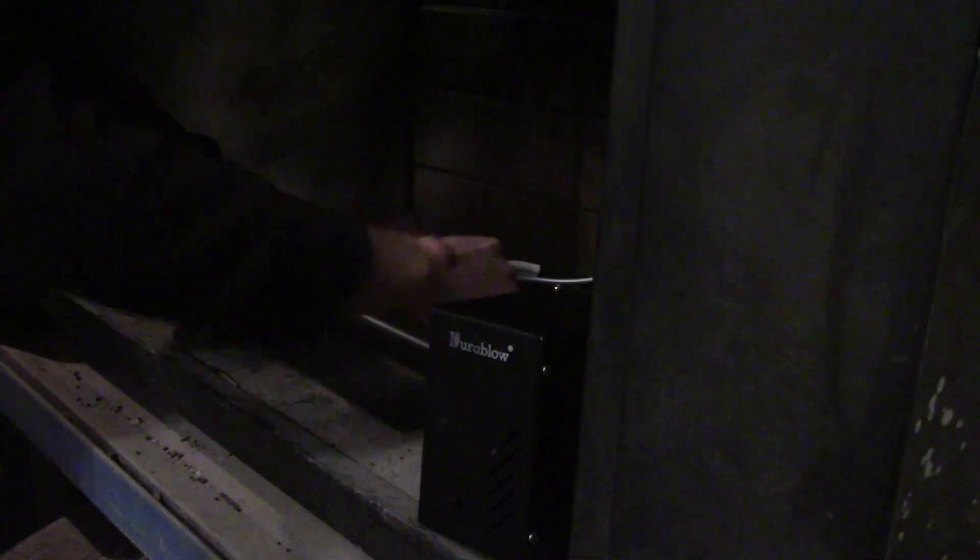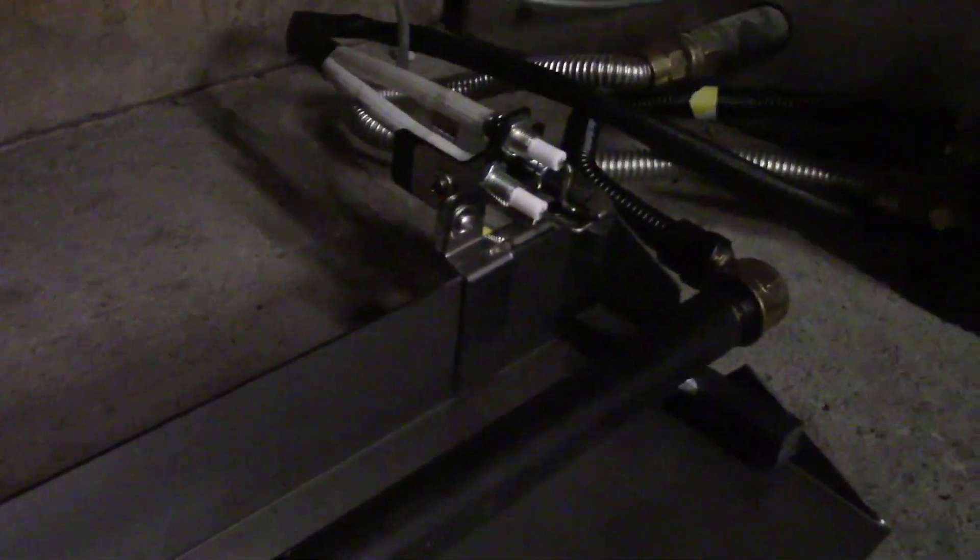I'm going to use this bracket, clip it onto the back of the pan — I'm sure this could be retrofitted on other units. I'm just going to get this pilot light into the right spot. Early on the burner, closest to the inlet, is a good spot. I did end up sliding it a little closer to the gas source. With that bracket it's really easy to move around — I like that.